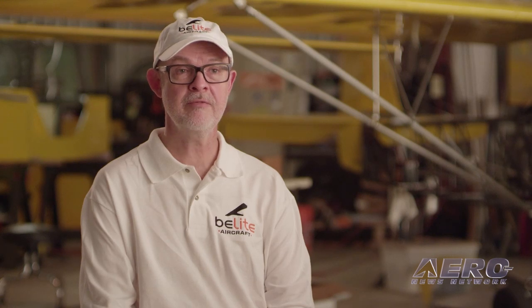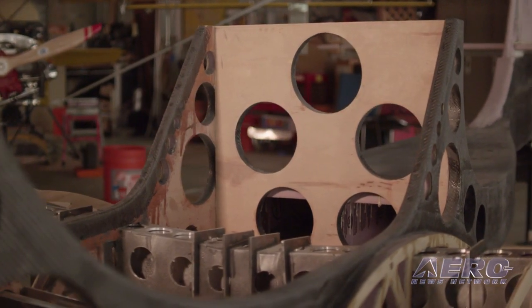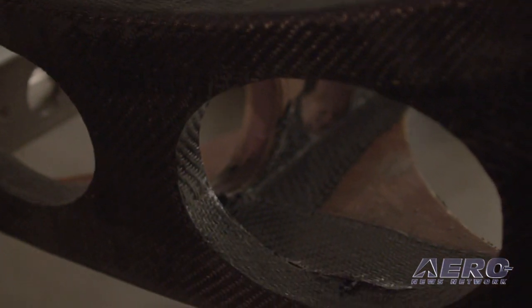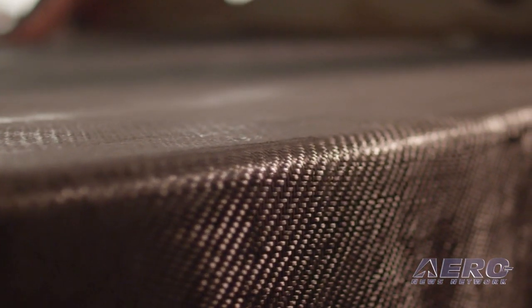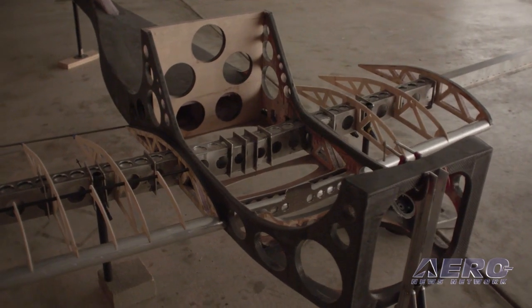The cabin is made from precision-cut wood panels. They're bonded to foam using glue and then glued together into the form of the cabin. After it looks like a cabin, we apply a couple of layers of carbon fiber cloth. You end up with a box shell construction that is just very light and very, very strong.